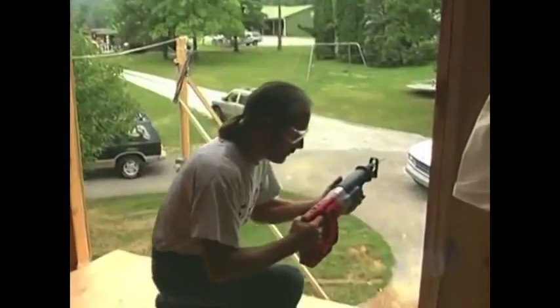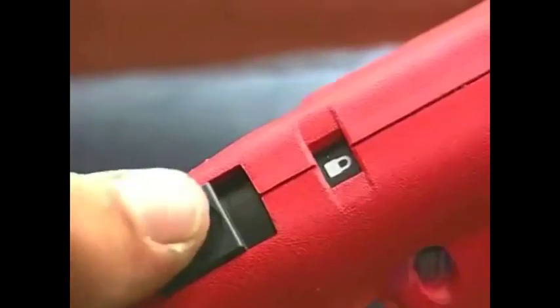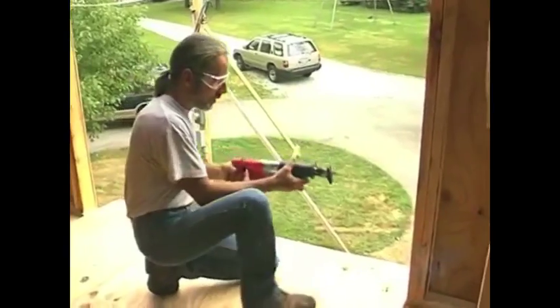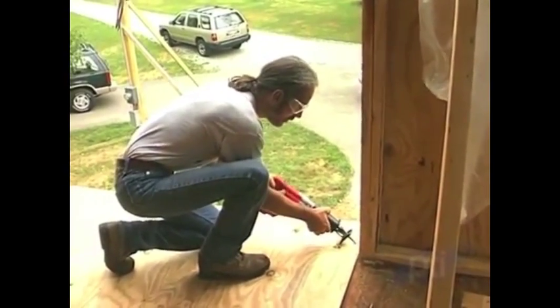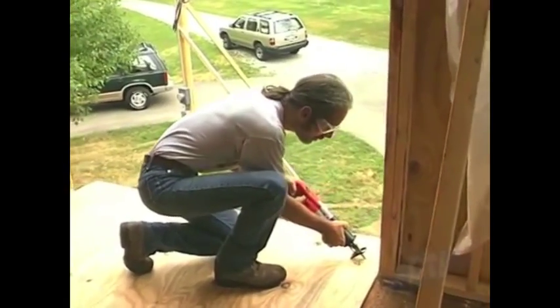And you also risk injury from loss of control when the cutting surfaces of the tool are dull. You have to keep your drill bits and saw blades sharp, and let the tool do the work for you. Taking a dull saw blade and forcing it through a piece of wood not only gives a very bad cut, it's also dangerous because you're overexerting on the tool. You can lose control, lose balance as you're forcing the tool to do something it was never designed to do.